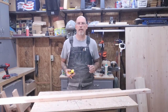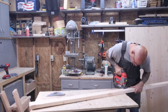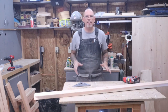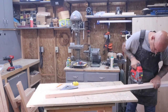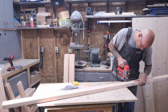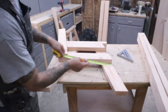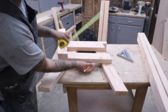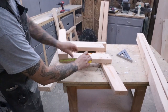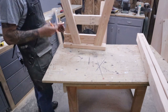Now I'm going to measure 44 inches and cut two pieces for the seat supports — straight 90-degree cuts, good to go. We'll also need seven pieces at 47 inches for most of the seat slats, and one more piece at 44 inches. Once all our pieces are cut, I'm going to come in five and three-quarters and put a mark on the bottom of the seat support, then come in five inches from the other side and put a mark, so when I flip it over I'll know where to put the screws for our seat supports.